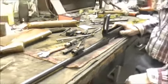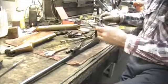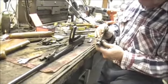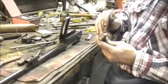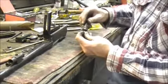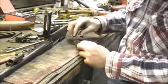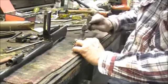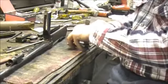That's really about all I can show you. I might go back through the reassembly process because there are some things — once you get it out of the gun, we're going to be bluing this gun and finishing the wood, restoring it back so it looks new. While you've got the thing out, get the crud and grease and grime out of there. Put your timing piece here — it has a little pin that it swivels on; it'll fall right out. The only thing that holds that in place is the bolt cover. To put that bolt cover on, you just kind of roll it on one side and tap it on, and it should just pop right back into place.